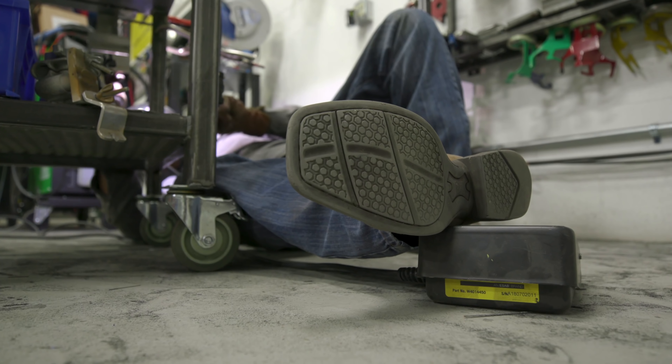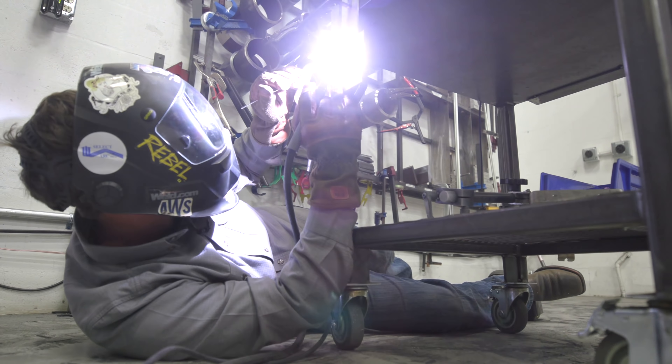We want to light up on our tack, warm up the tack, get the puddle the size you want for the joint. I'm running a T-joint here. Start dabbing and make sure your toes are wetting in pretty good. Just keep watching it. As I get like halfway or three-quarters through, I'm paying attention to the base metal because sometimes it will start eating away the top plate. Just keep going and slowly let off on the pedal. If you're running a little warm, the top plate of the T-joint right in the middle will start fingernailing back — you'll see it lifting up, trying to poke through the other side.